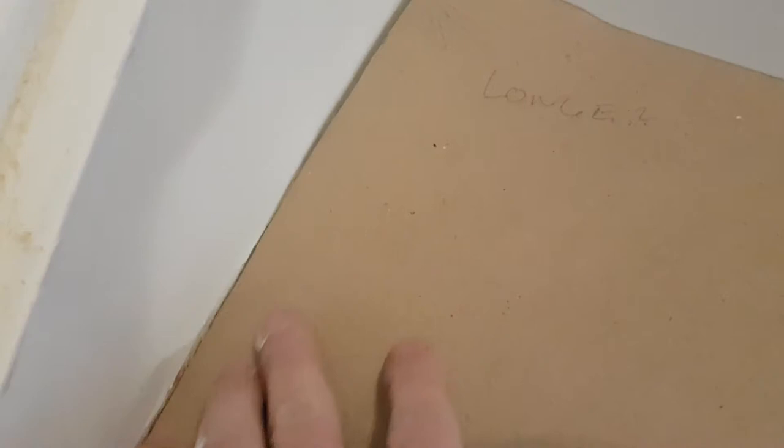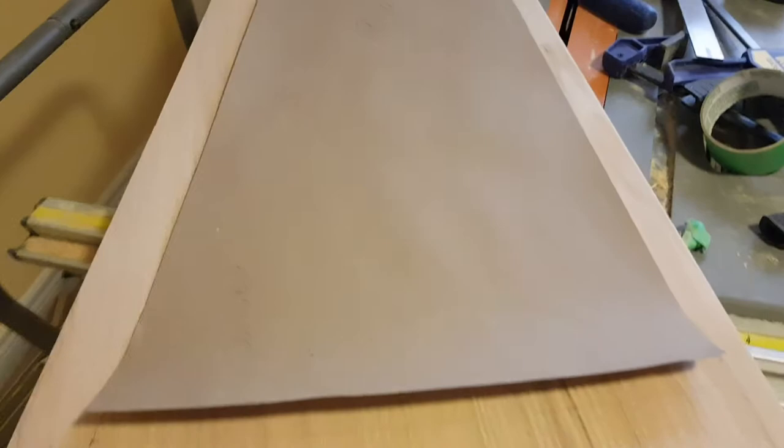You take your craft paper and you line it up and cut it flush with all of the edges. Scribe it to fit. And then trace it onto your blank tread. Tape it down, trace it on, and then cut this. I am using a circular saw, and I'm setting up a straight edge, cutting along that, and then jigsaw on the rest, and then take it down, fit it, you know, belt sand, adjust, take it down, fit it, you know, two or three times.